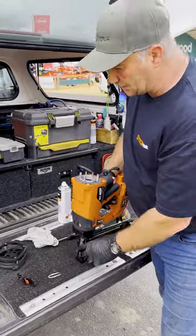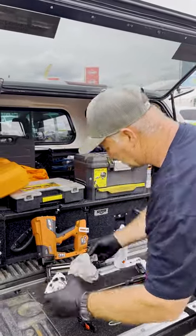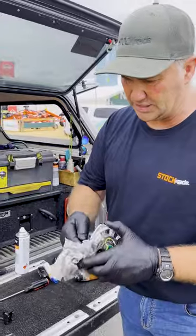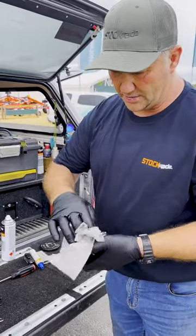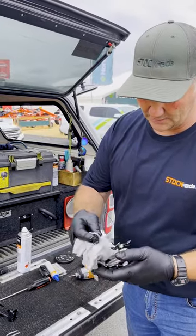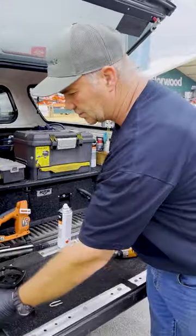We're going to put that aside and let it dry. Using our wet rag, holding the motor and fan assembly, gently wiping around the o-rings and around the motor to take any carbon deposits away. Super clean — put that aside to dry.